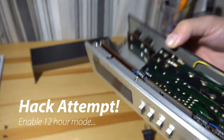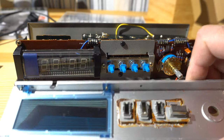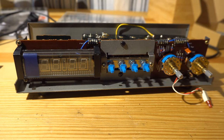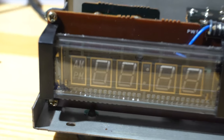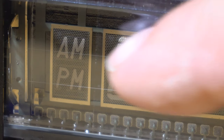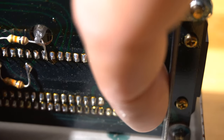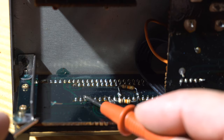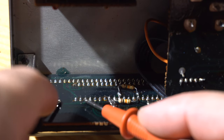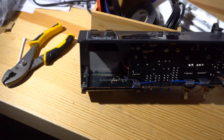There's a blue piece of tape on the left side of this clock, which is odd. There's the glue - that's the reason the buttons are sticking. We're going to clean up that glue and fix that problem later. If you look at this, let's take off this blue piece of tape - look what's behind it: AM and PM! So it's like they manufactured this with AM/PM capability and then just hid it with a piece of tape. So there's pin 38 and it does have something going to it and it is tied to ground. What I did was use a screwdriver to scratch away this trace, which removed the conductivity between that pin and the ground. So let's plug it back in and see what happens.